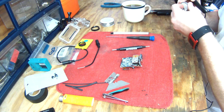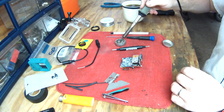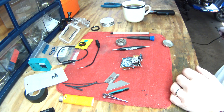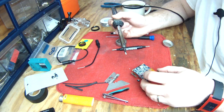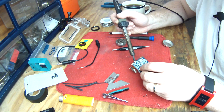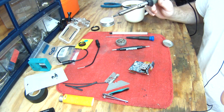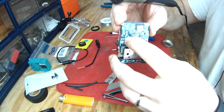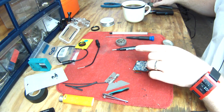We're going to start by cleaning my crappy soldering iron. I've got some tip tinner and cleaner — just a little cheapo tub of stuff that makes a crappy soldering iron a little more useful. Just like that, just a touch of the iron and the old microphone is away. Now, looking here on the main board, there is a little plus on the positive side — that's what we're going to solder our two wires to for the dual mono setup.